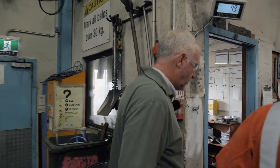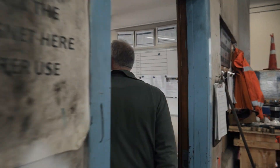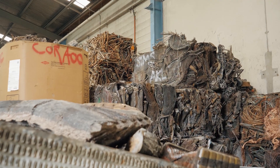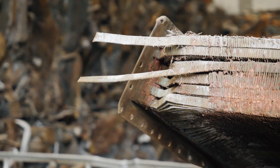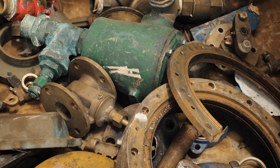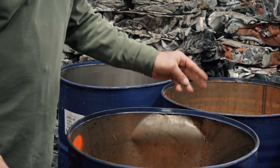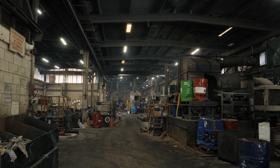Once it's been densified we then issue it onto a charge. This is where we put together the charges so there is a bit of science goes into it. You can pick from a library of hundreds of different ingredients, put them all together, make sure that the chemistry all adds up, print out the charge sheet and then the guys will physically pick the individual ingredients that they need, put it together on a pallet and then it's lined up ready for the foundry.